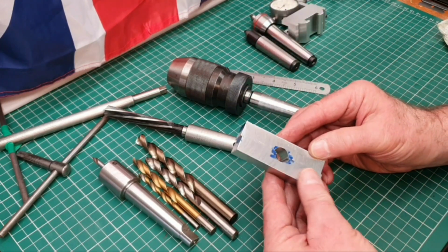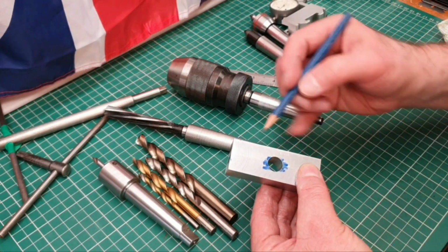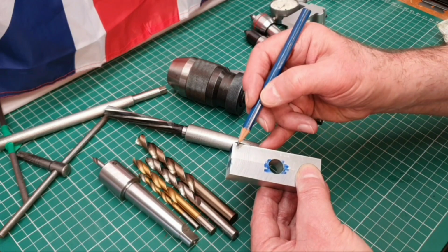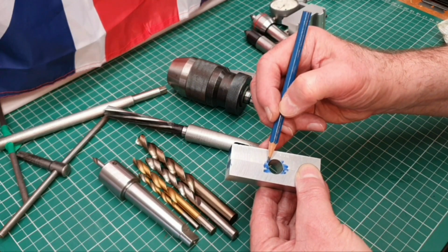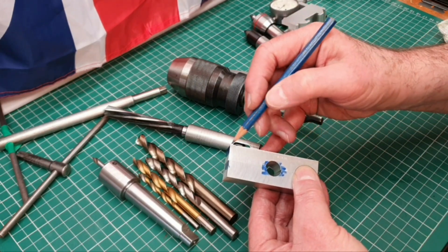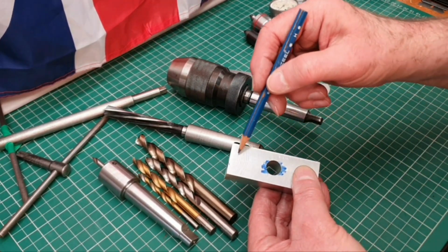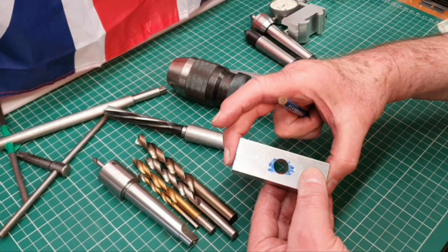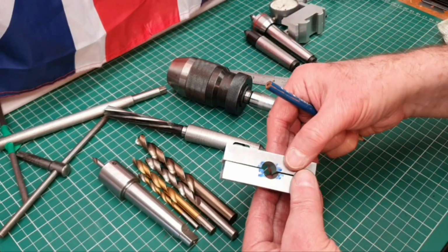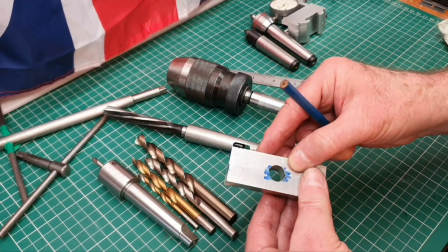So as I mentioned, the next job will be working out what angle I need to machine the sides here. Obviously the angle is going to be, I guess, from about here out to here, so I'll roughly work some positions out and then use my angle setup blocks to work out the ideal angle to machine those out. That's obviously going to be quite a long job because I've got 4 of them to do, but that is the last job on this particular part. The next part along from there is making a shaft to go through the centre that these bits will swivel on.